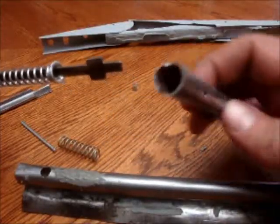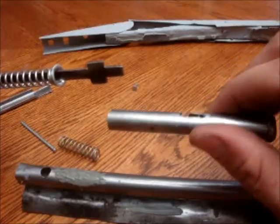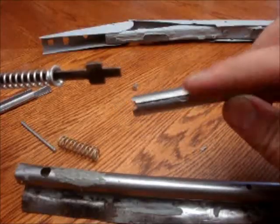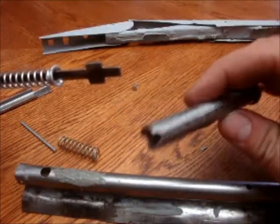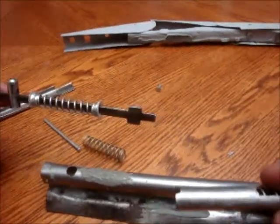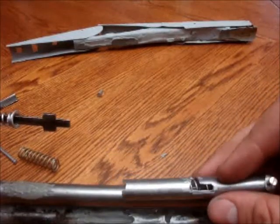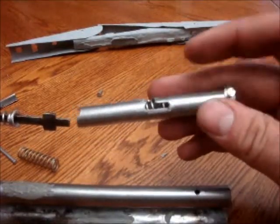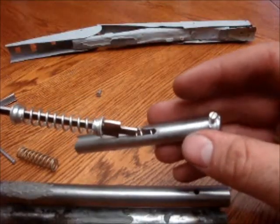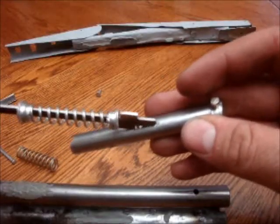The tube itself I made out of a piece of sheet steel around a half-inch mandrel, then brought it down smaller by grinding the edge until I got the right diameter. Inside the tube, in the safe position, there's a pin visible here — it allows forward and backward movement, and that's how you cock it.